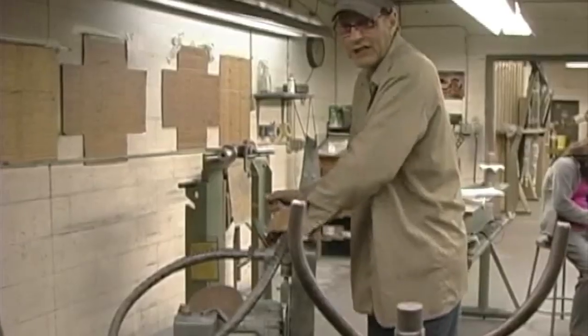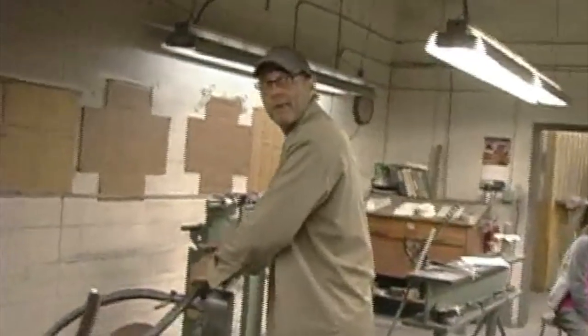I usually start out with a 50 grit, real aggressive. Then I go back over that with an 80. That gets out those marks. And then I finish up with two Scotch-Brites.